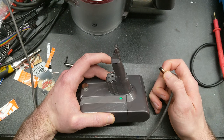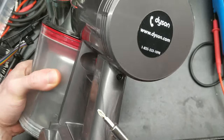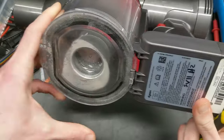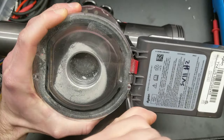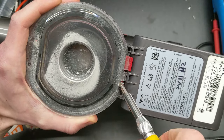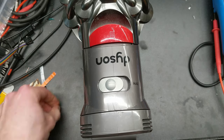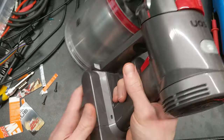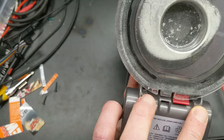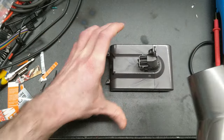When you disconnect the charger, you get your out-of-balance indicator again. To remove the battery on one of these, there are three screws: one at the top and two at the bottom. These might be Pozidriv but you could probably get a Phillips to work too. Once you've undone the three screws, the battery will just slide out of the bottom.